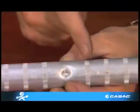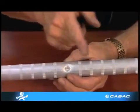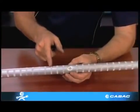All overhead sleeves are crimped from the center outwards, ensuring both sides are crimped evenly. If this were not done, the connector would form a banana type shape and would not be suitable for service.